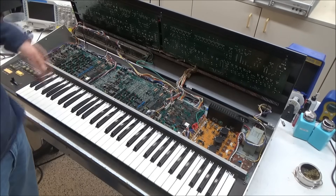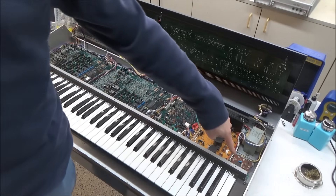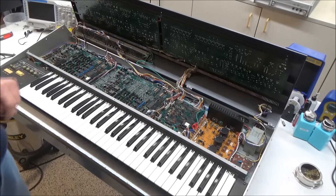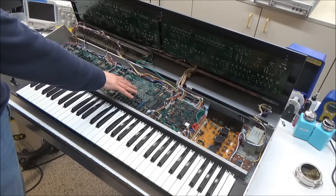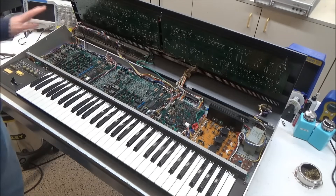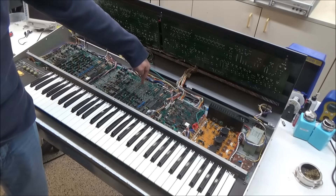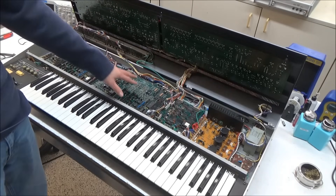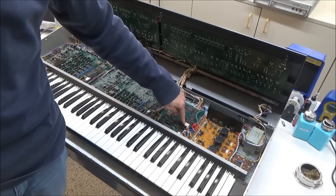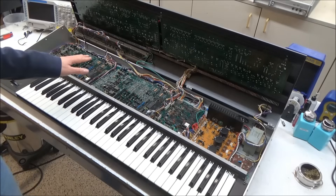So here under the hood you can see what we've got going on. There are two pot boards or panel boards, an output board, a little AC filter board, a power supply board, CPU, and key assigner board. Then you have two boards here called the module boards or voice boards — each board can support four voices. This is a six-voice synthesizer, so this board is fully populated and this board is missing some components, giving us four voices and two voices respectively. There are actually three CPUs inside the Jupiter 6: one on the key assigner board with its ROM, and each of the module boards has its own CPU and ROM.